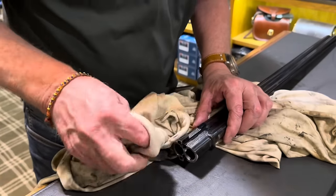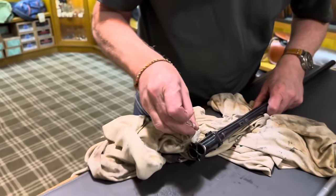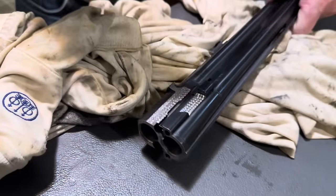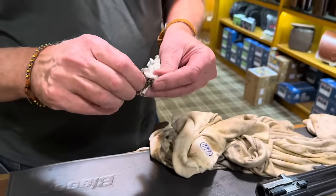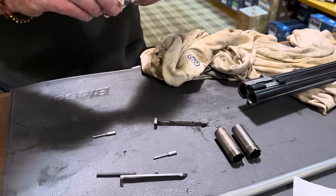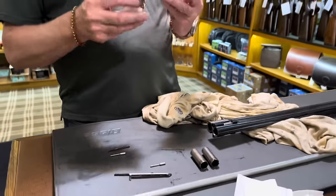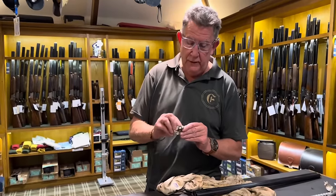There's plenty of oil been slathered around this in compensation for actually cleaning it — it won't go rusty but it will gum up. They're clean and dry now, nice and shiny. So that's the point of re-lubricating. You don't have to do this every time, and if you do, do it somewhere where if you fire that spring out — because it will come out at a rate of knots — you don't lose it.